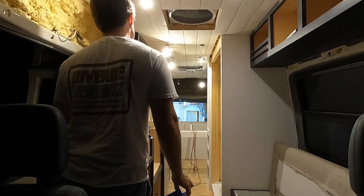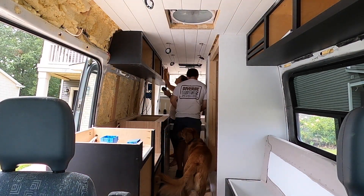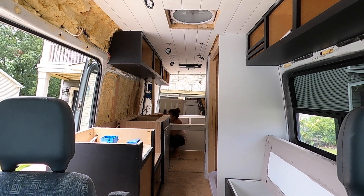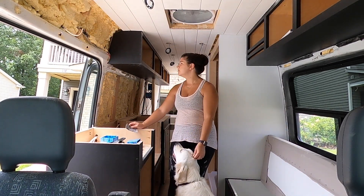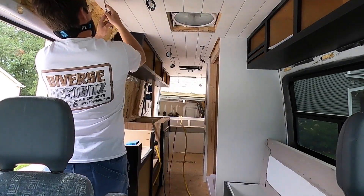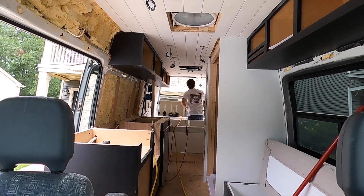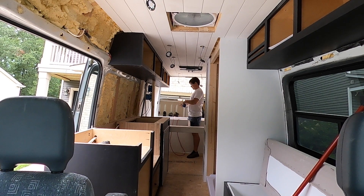I finally broke out the power sander to get the final bits sanded up and ready for paint. We got the bulk of the sanding done, and now we're filling in a couple of nail holes that I noticed while sanding — I marked them and Lauren is coming back with the spackling to fill those in. Then next step is to clean out all the joints: I'm taking a putty knife and running it between the shiplap to make sure all the spackling is out of the joints and everything looks nice and clean.